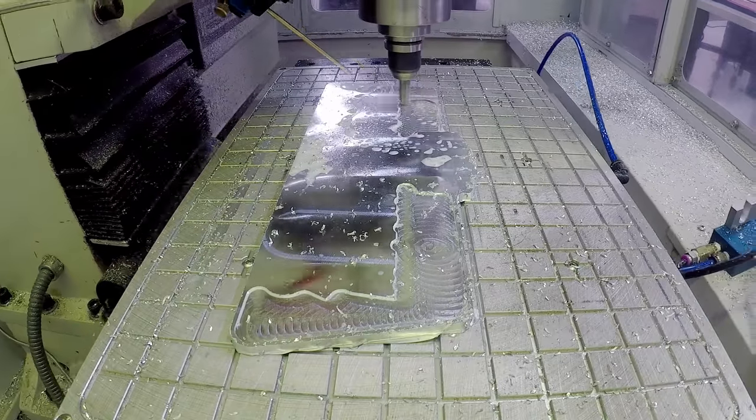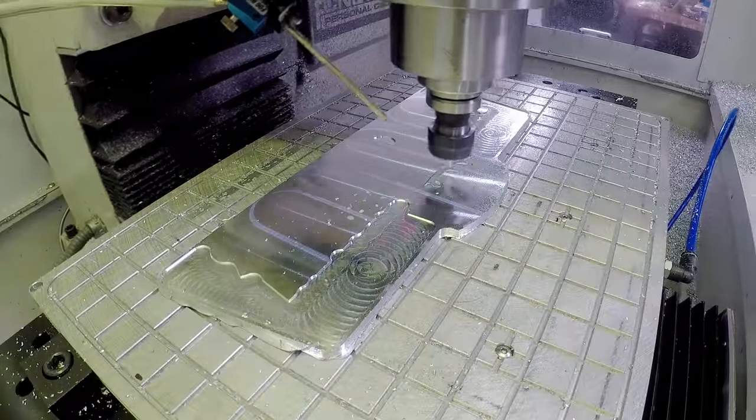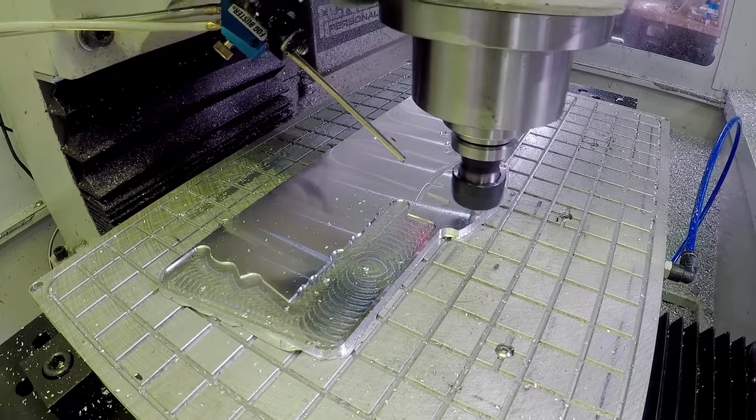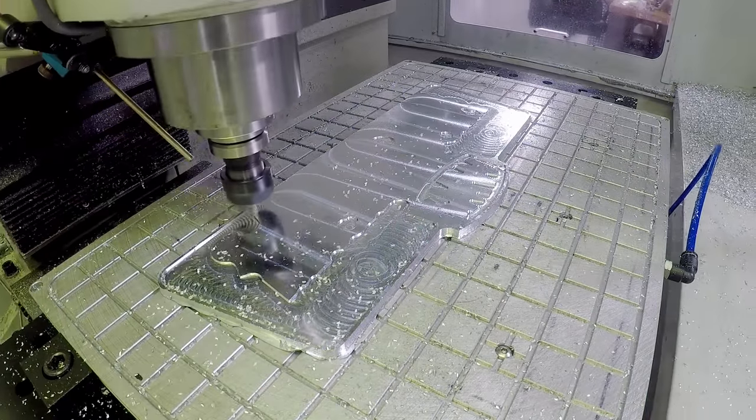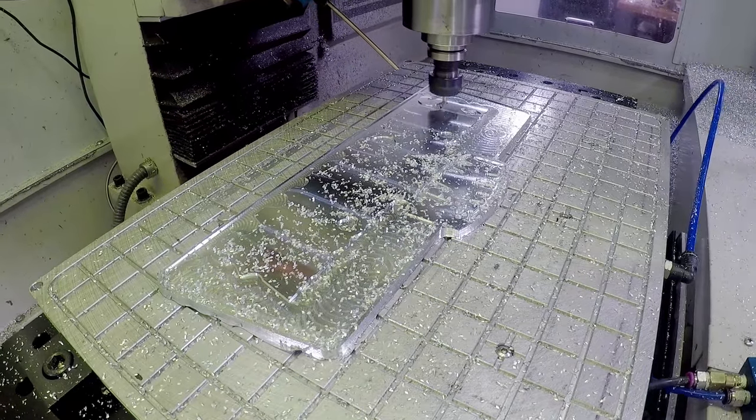With the vacuum plate, we don't want to have any sort of accidental linking moves that ramp in at too high a feed rate. You know, something like when in your vise, it wouldn't be a big deal. The tool probably can take it. But with a vacuum plate, that extra shock could bump it. And then just progressively stepping down.